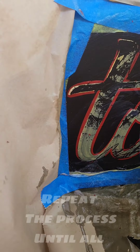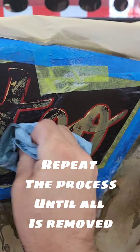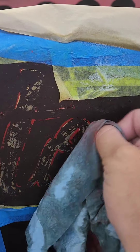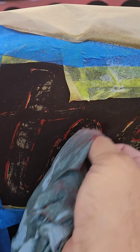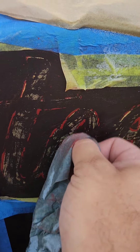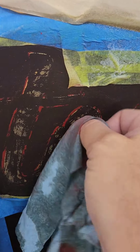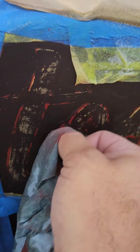As you can tell, this process takes steps: spray some, let it sit a few minutes, work on cleaning it, give it a little bit, spray some more, keep going back. I think I probably had to do it four or five times before it really started breaking down the enamels and the glue, or the size, on this job.